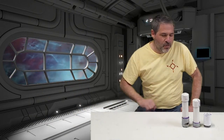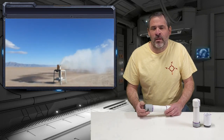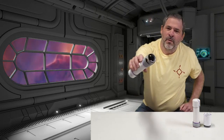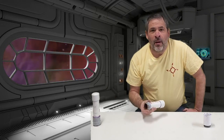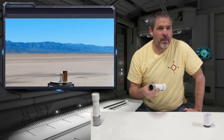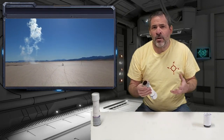So it's been a couple of days, and we've done two ground tests on this motor and nozzle design. Unfortunately, neither of them went very well. In the first test, we had a major blow-by issue where the gases got around the nozzle washer and escaped through the threads of the fitting, and eventually the nozzle just popped out. About half of that aluminum retaining ring is just completely gone — it didn't blow out, it actually got disintegrated. We learned some lessons on that and went on to number two. This one didn't go very well either. Basically, the gases got around the washer again. We sealed up the threads and got the washer as tight as we could, but it still managed to get around it. The gases got into an area of the fitting where it wasn't supposed to be, heated that up, pressurized it, and exploded the fitting.